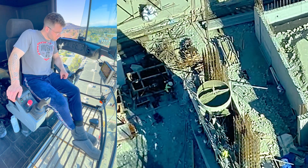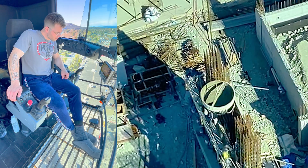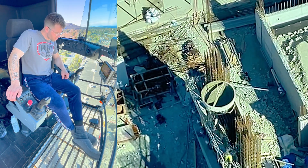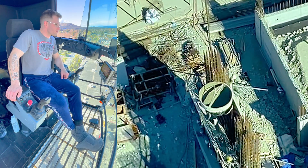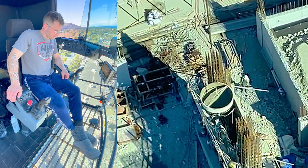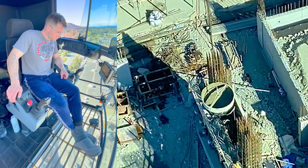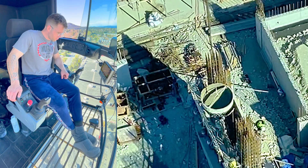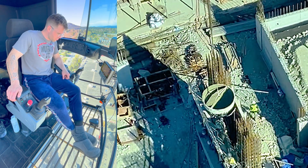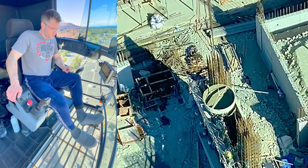They're figuring out what needs to happen — it's actually really hard. You would think you could just pour all the concrete into this one void and it would spread out between all the rebar zones, but it really doesn't. It's hard to move the concrete once it's placed. So you actually want to point the chute directly into these rebar zones, and then it makes vibrating the concrete and filling up all those voids that much easier.